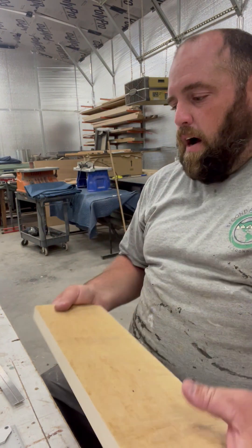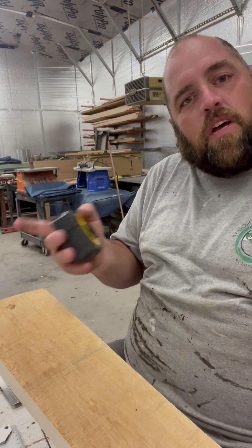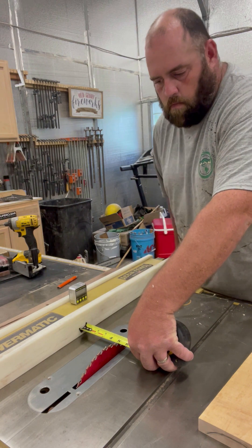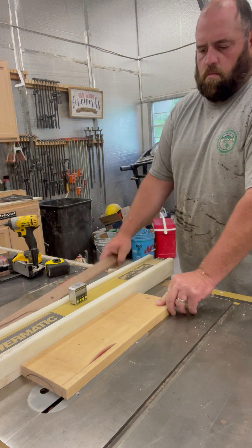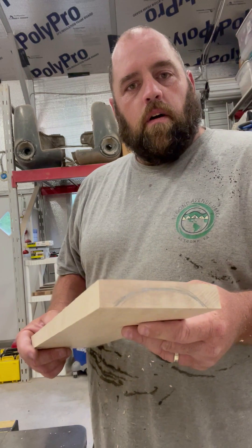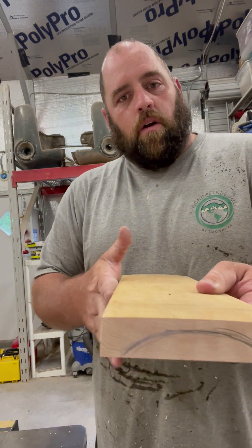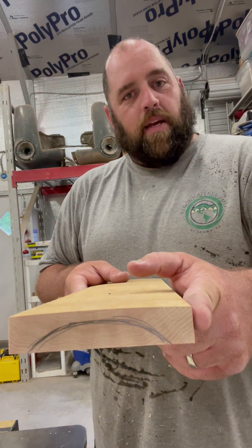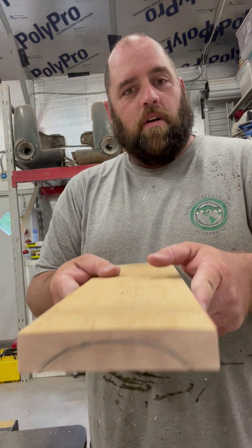The next step is taking this piece of wood over to the table saw. We want to go ahead and rip that to width. This piece right now is measuring five and five-eighths inches. Let's rip it down to five inches. We referenced the flat side down with our 90-degree edge against the fence — the table saw fence is 90 degrees to the table. Set the blade to five inches, ran it through, and now we have a five-inch wide piece. That's steps one, two, and three for width.